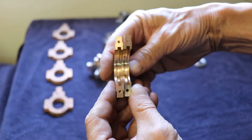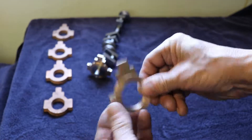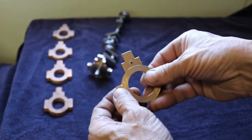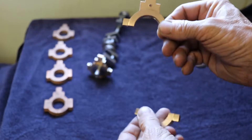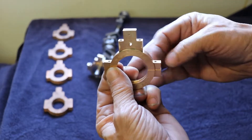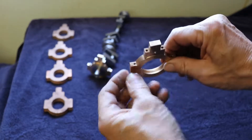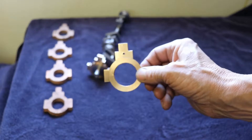You can see the two little holes to the oil journals, and the groove. Once it's all bolted together, it's captive on the eccentric and cannot move. Then I drilled these holes — these I drilled out to a larger size before tapping the bottom holes. I drilled those to clearance size and drilled these to tapping size. Then before unsoldering, I tapped the bottom parts and then drilled those out. That's how I did that.